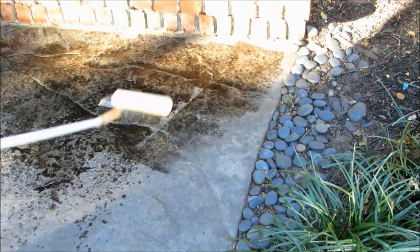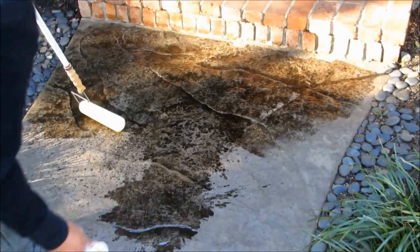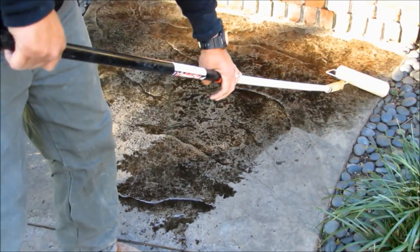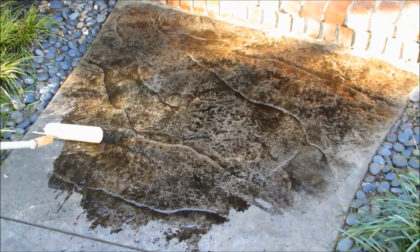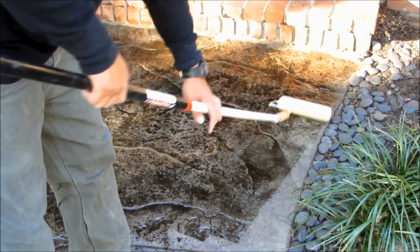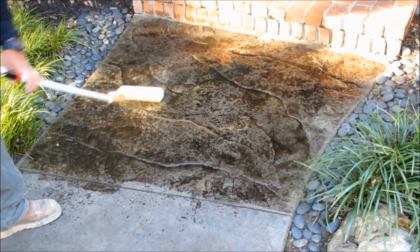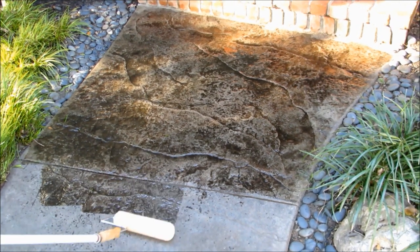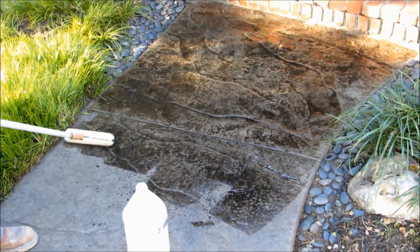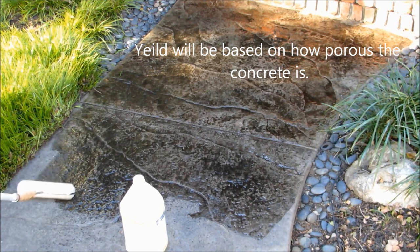We have an acrylic material here on this deck. You can just pour it out, put it in a bucket with a roller, or just roll it out and dump it out — keep it going. If it puddles up a little bit, that's fine; it's just going to work a lot better. The most important thing after it's rolled out is to just give it a little time and keep checking it. You can see he's getting really great yield out of this — the Endurable Power Stripper typically covers about 150 to 200 square feet. That's about a 4x5 section and he's barely touched that bottle.